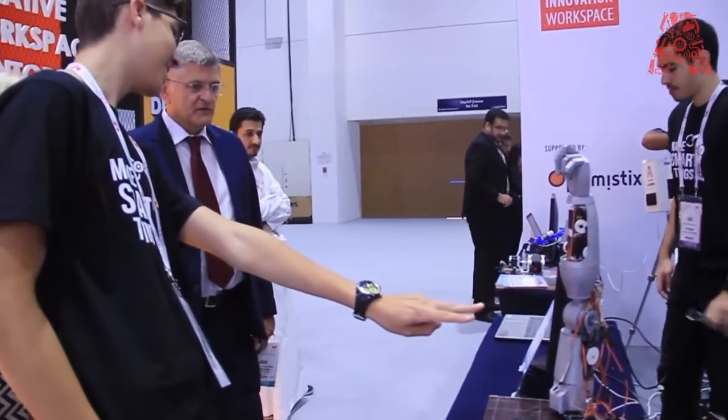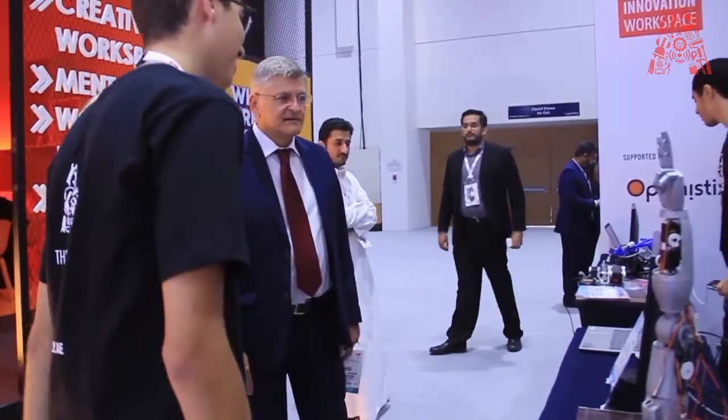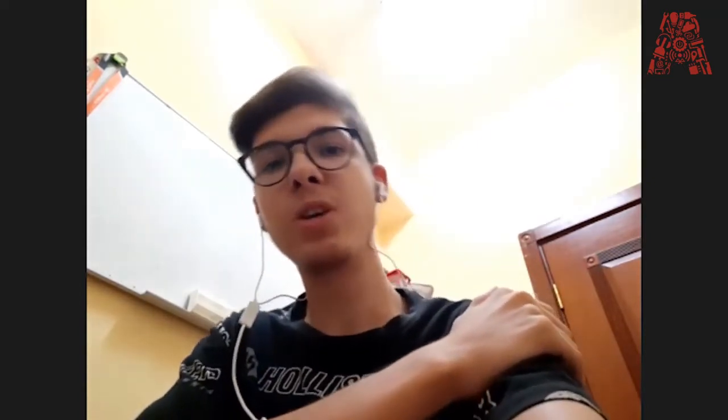My name is Ziniti and I worked on the revamped humanoid arm. In the first version, user inputs were taken through a LeapMotion sensor and replicated on the arm. In the new version, we added a game mode for rock, paper, scissors, which took user inputs from the LeapMotion and played against the user. The inputs were run through a neural network to identify whether the user showed paper, rock, or scissors. The neural network sent signals on the serial monitor to the Arduino — for example, sending 'A' for paper and 'B' for rock — and the Arduino would process it and play fairly against the user.